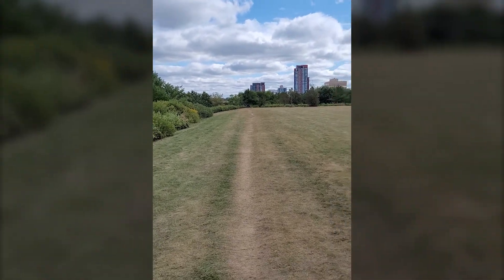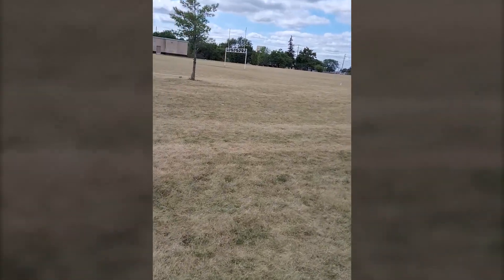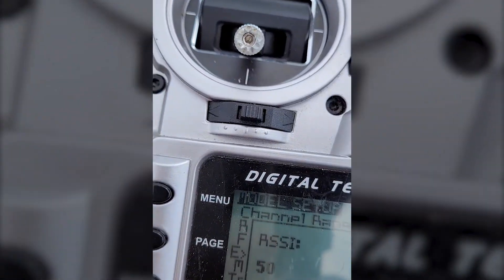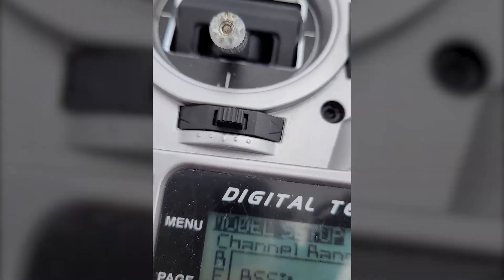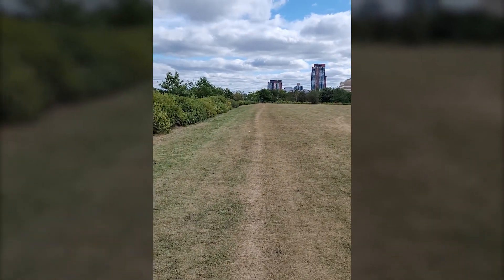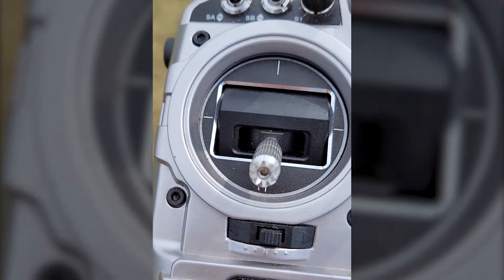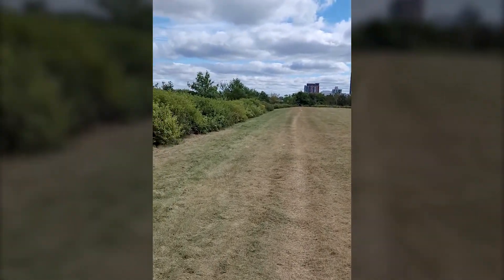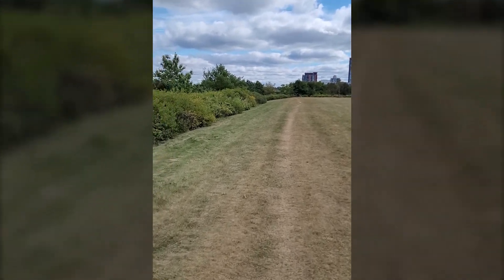I'm going to show you how to make this T-dipole antenna — these antennas come with TBS Tracer. Walking a little further and it's still 51, even longer. Still 48-49, the range gets really far with this modified antenna. Still reading 48, 49, 50 — the antenna is so good, you get more range with the T-dipole. I'm going to modify all my quads running 2.4 gigahertz.